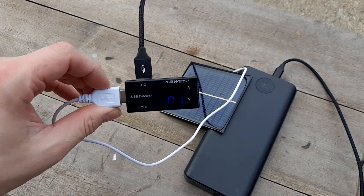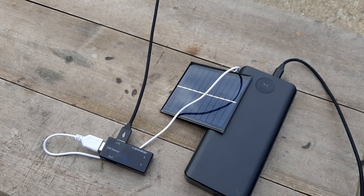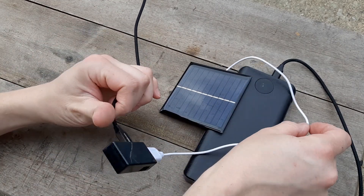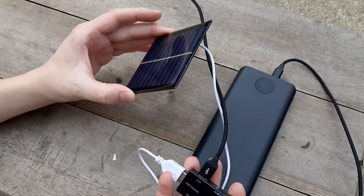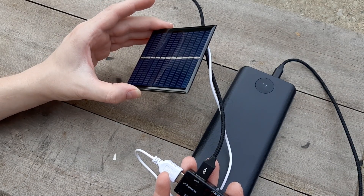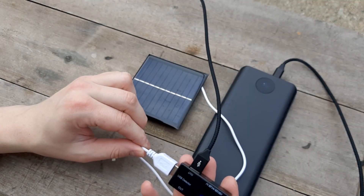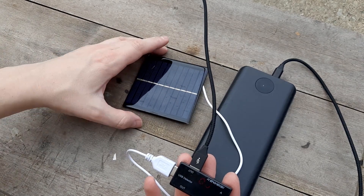I messed around with it quite a bit. You might be able to see 4.06, 4.05, 4.07 volts and 0.00 amps. I'm trying to verify it by putting it in the dark and getting out of the sunlight, and even in follow-up testing the next day at noon it was still reading 0.00 amps. So one of two things is going on: it has some kind of weird minimum threshold where it won't read some fraction of an amp, or even though the power bank is showing as charging, it doesn't like the 4 volts because USB runs at 5 volts. Something is happening, but I'm not able to actually draw current. Even at max sunlight tilted directly at the sun at noon, I still wasn't able to pick up even 1% on the battery bank.